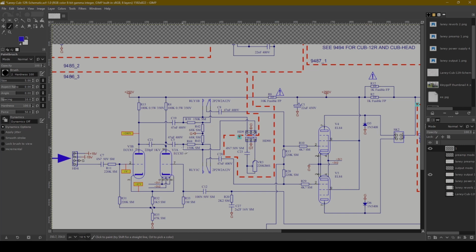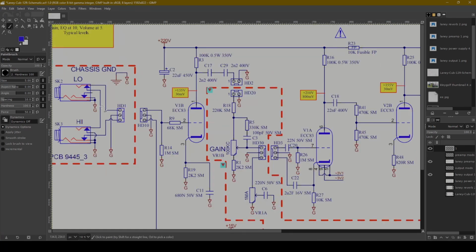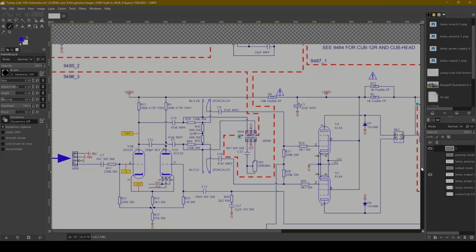So I think what's happening here is you've got this relay here. And I think what's happening is when you go into, let's bring up our preamp again. When you go in here, if you're in the high input, then it bypasses this and it just goes through these decoupling caps and then here to the power tubes. And then same thing right here. But if you plug into the 1 watt mode, it flips the relay, and then instead you go this way. One goes in here, one goes in here, and then it runs into this post phase inverter master volume.